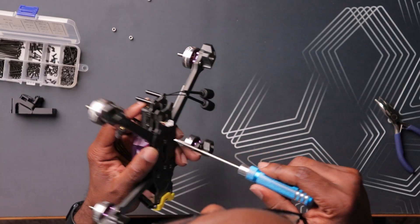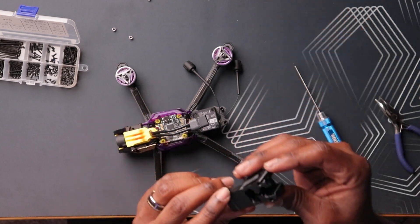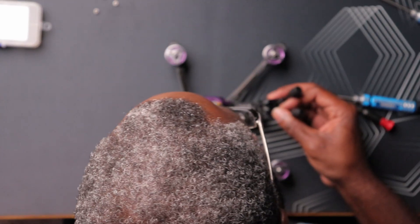While I have the space before I install this, I'm just going to plug the VTX into the flight controller — same harness. VTX is installed. I need to take off the top to install these antennas. I do have a TPU piece printed out specifically for this. I'm just going to fish the antennas through here — fish the other one through as well. We're going to have some pretty cool antennas once we're done. Both are in.